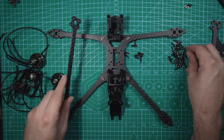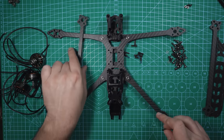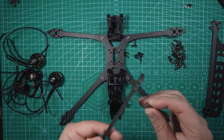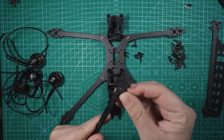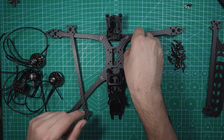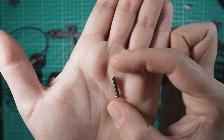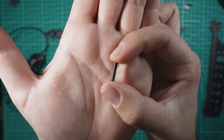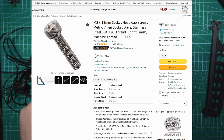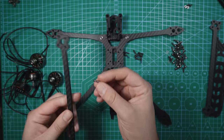So the screws that come with the motors are long enough to go through just these arms, but once you add this, it makes it a little bit thicker, and unfortunately these screws don't go through and don't reach the motor. So instead of using these screws, I have some M3 by 12 screws, and I'll leave a link to a kit of these down in the description. You can get these on Amazon, but this is going to give us enough length to go through this as well as the actual arm. So let's get the motors all mounted up.